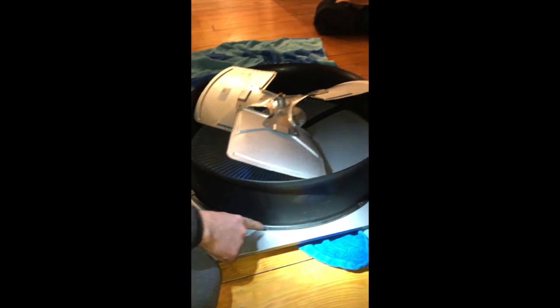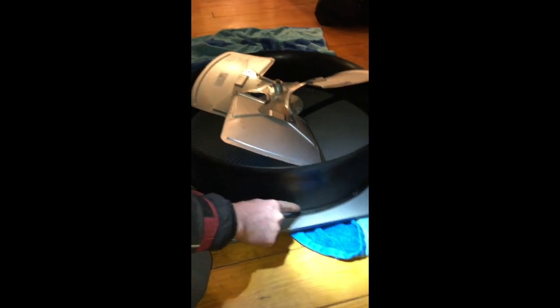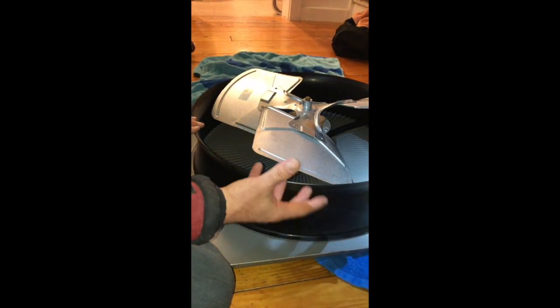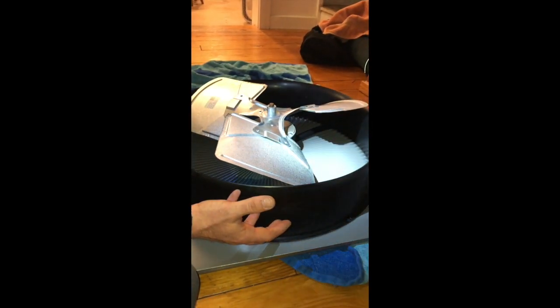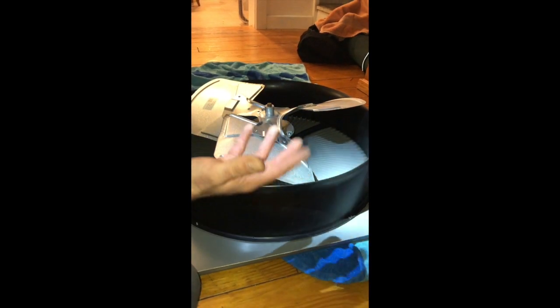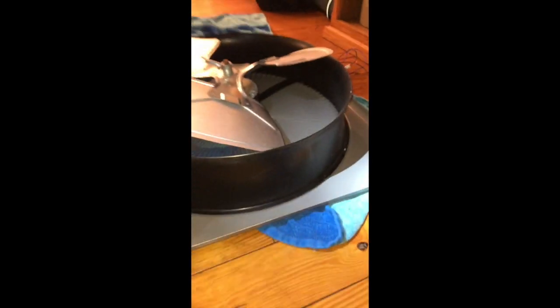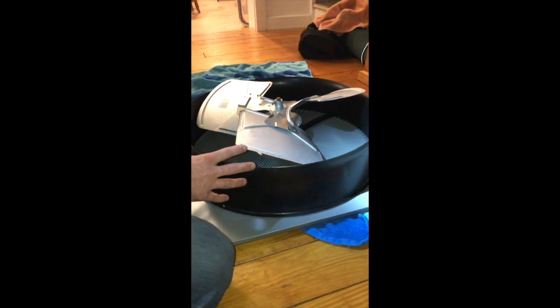And now what I'm gonna do is put some self-tapping screws. What I'll probably do is just drill some holes, and where they've decided to only install 4 screws, I'm gonna install another 4, maybe even 6 or 8, and just make sure that this shroud housing can never become deformed, even as it shrinks.